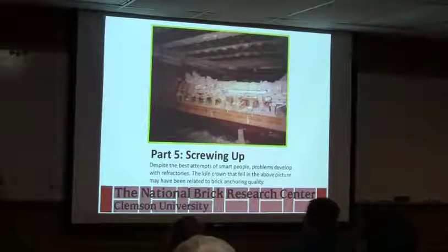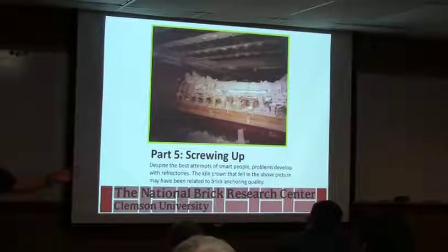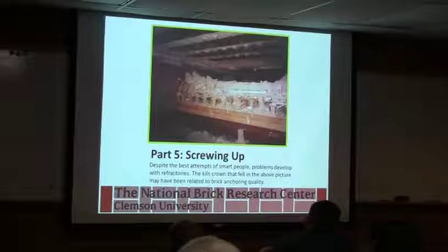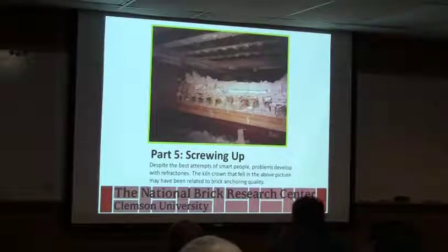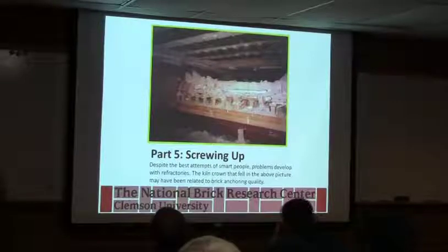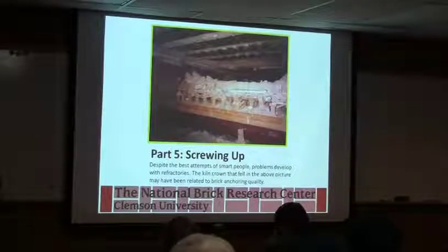In most of the processes that I've been involved with, I started off in the brick industry, and then I moved out into other industries, and in most of the other ones, when you lose a car worth of ware, no offense, the investment in that product is much greater than a carload of brick from just the financial investment that you have in it. But that doesn't say that you have your tunnel kiln going and all of a sudden you're in the middle of your hot zone and your car starts to drag and sticks and you can't push it through. That is a huge problem.